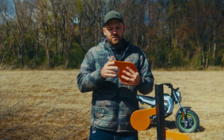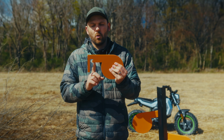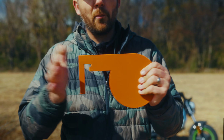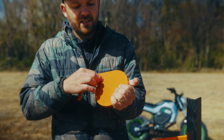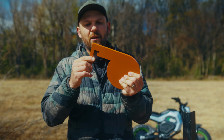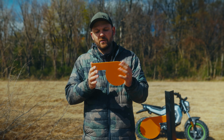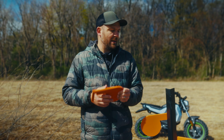The paddles themselves, although I was impressed with that gusset, I learned something many, many years ago. You don't want sharp corners anytime a line intersects when we're burning AR-550 or AR-500 steel. Where this thing will break over time, you'll see cracks forming from this corner, and they'll start to spread out. Because this little leg is so tiny and all of the impact forces are exerted on those tiny corners, and there's no radiuses on this paddle whatsoever, I would assume that in a couple thousand rounds or less, this thing will break.